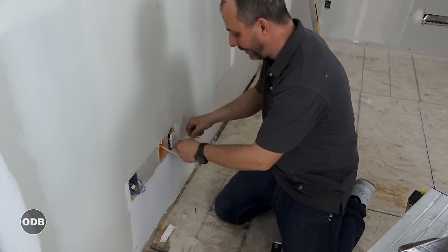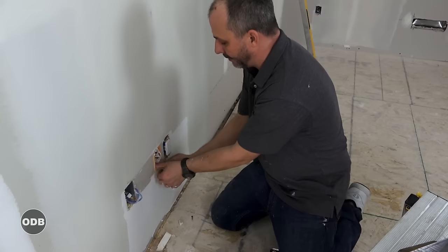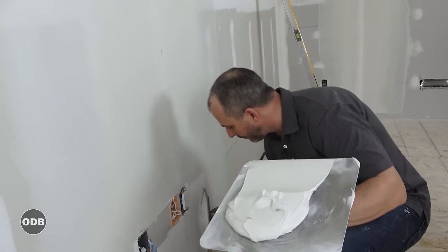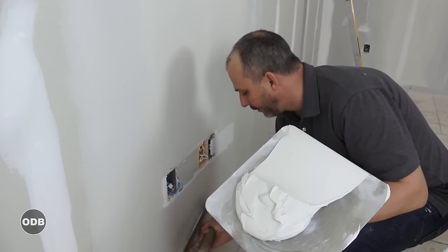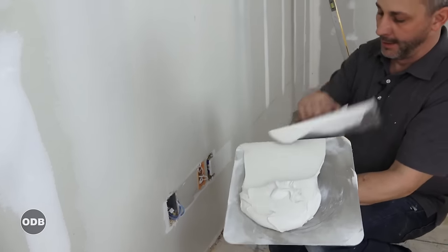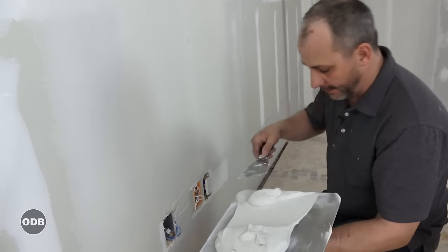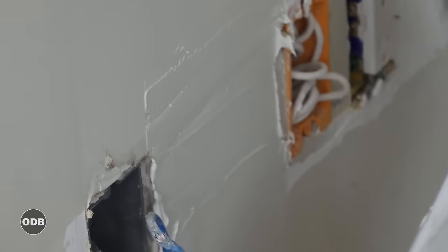This is the TV wall, so we've got a channel built up here where we can actually pull cables from the entertainment center to the TV that we mount on the wall above. The reason we're going to fill down here is so that the surface of the wall is the same all the way around these plugs. When you're done and you go to put your cover plates on, you don't want to have mud rocking around — it will look obviously ugly. Take your knife, fill up these gaps, and make sure that mud depth is very consistent all around your plugs.